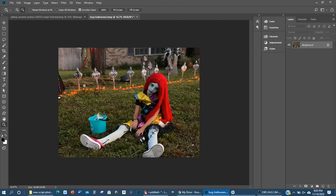If you work from bottom up in one direction only, keep one speed, and only increase your power until it goes past perfect, then bring your power back down to where perfect was. This process at 250 DPI has been made to edit the photo without sacrificing quality in the end result for speed. At 170 millimeters per second for 250 DPI you can go much faster with a 2.5-inch lens.